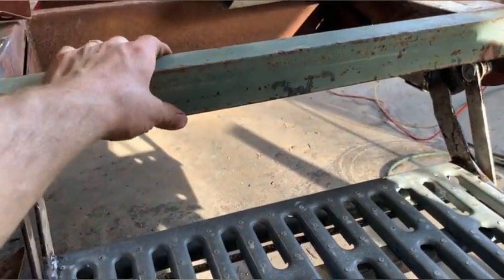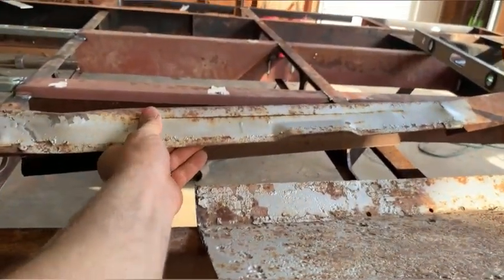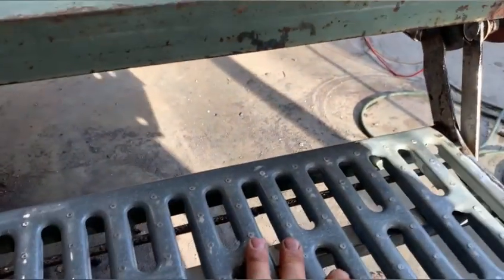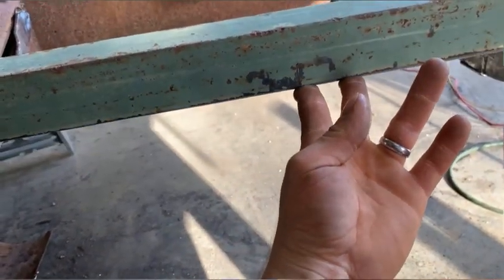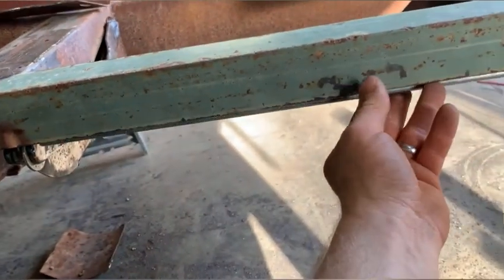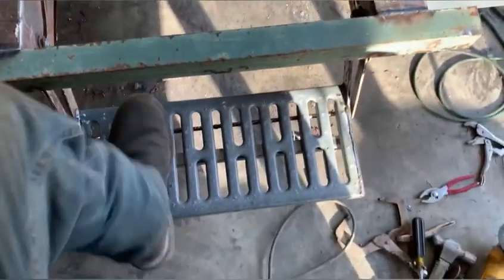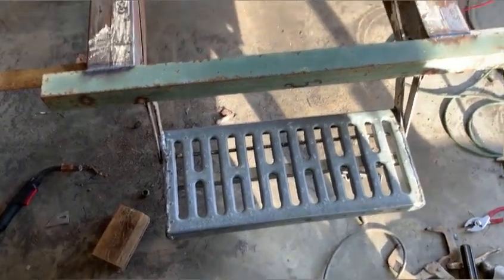I added this high carbon steel angle iron. Before, that's what they had up there - and the original latch was cut so it was like a spring and it just latched right on. But it was all kind of cheesy and rusted out, not very good at all. Now we've got a good solid step. I think I might get a latch like they use on a toolbox, put it underneath with a small hook - put it up, hook the loop over and buckle it down. We'll see what works best. Next we've got to work on getting the rest of the support welded on.